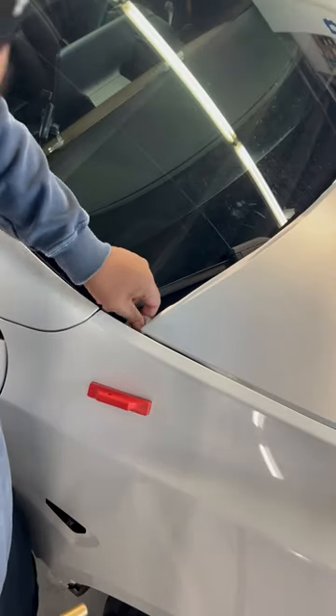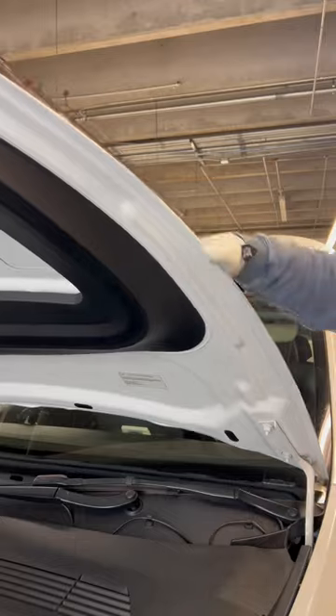For the corner, I like to heat it up, tuck it under, and cut the excess. Then you'll work all your cut material down, and your finished product should come out something like this. Don't forget to post heat.